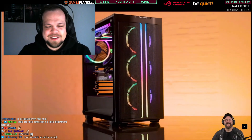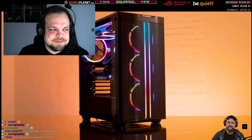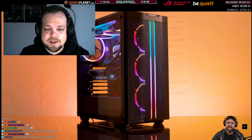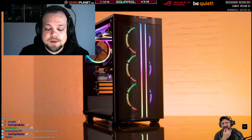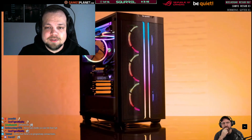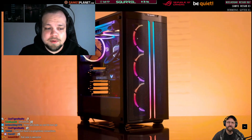I used the ARGB controller from our Silent Wings 2 to demo it. What I also want to highlight is that yes, you can hook it up to any ARGB motherboard — you can control it with any software you like. It's compatible with any 5V ARGB standard. It's not a proprietary system, which was really important to us. That does mean you might not be able to select each individual LED, but it gives you the freedom to choose whatever software you want and doesn't lock you into a certain ecosystem, so you can combine it with ARGB components from other companies.